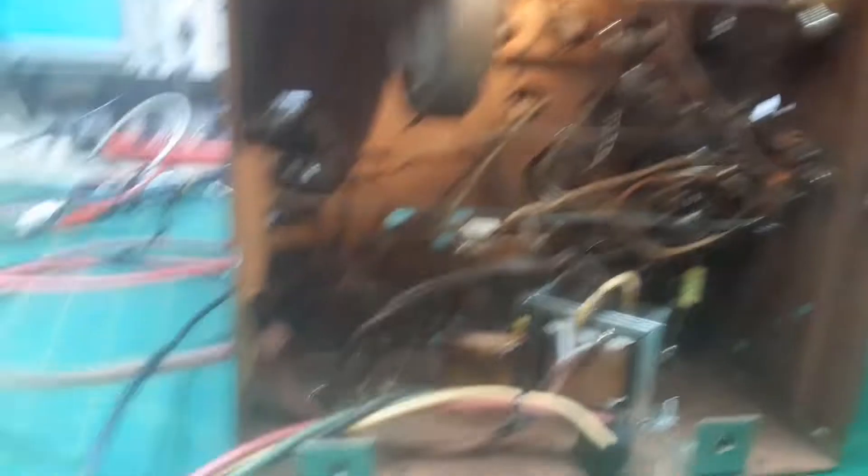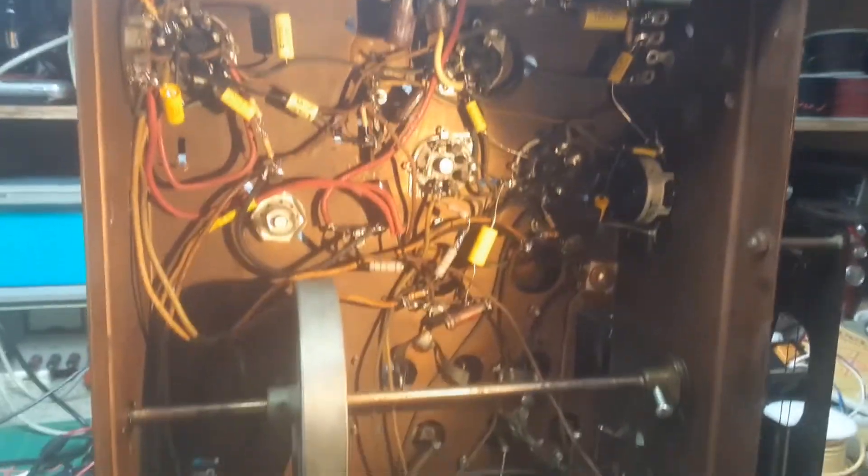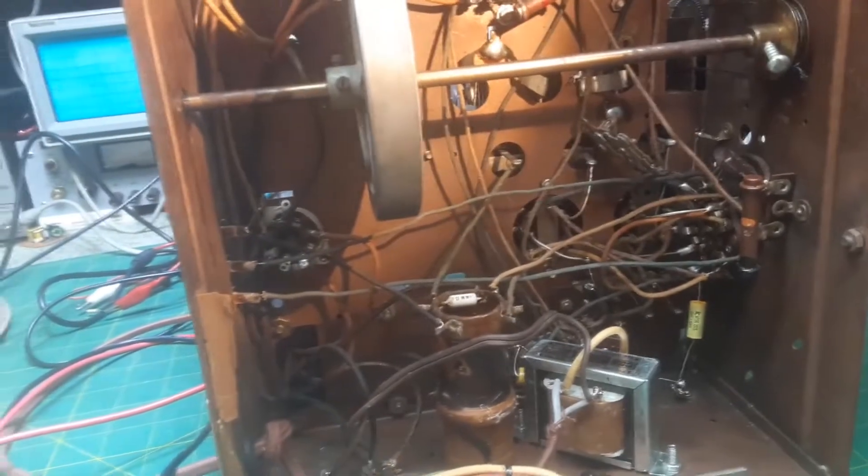Radio's playing fine. Get it in the case and I'll show you a final on it. But yeah, it needed a lot of work. They had capacitors going from the right place to places they didn't belong, they had the wrong values everywhere, and they had the electrolytics totally messed up. That's what blew out the original field coil.